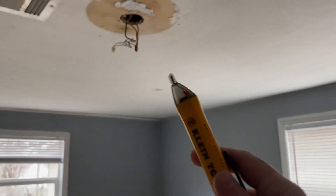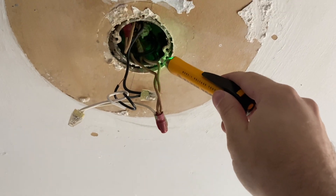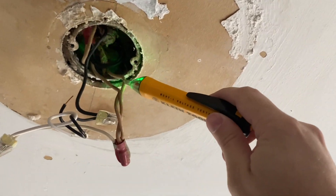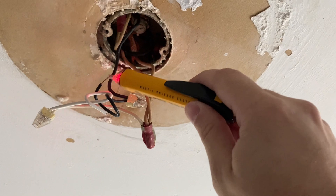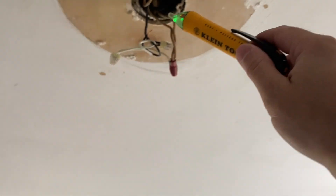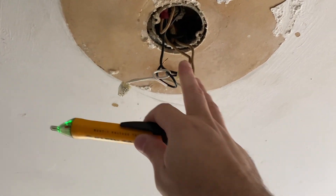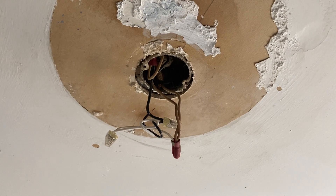Okay, so you can see now there is heat on those black wires but not on the white, so we're good. There's no white wire that's actually hot — they used to do that in older houses. This is all neutral here; these blacks are going to be hot. Let's check — okay, this is all safe. I'm going to turn the light switch back off, check one more time — yep, we're good. I'm not recommending you do this; I would shut it off at the main breaker if you can.